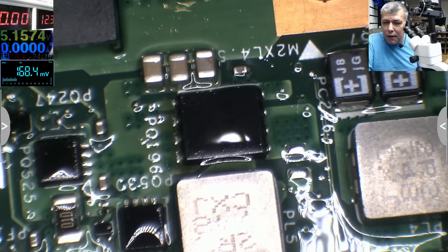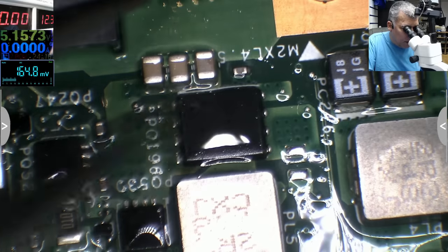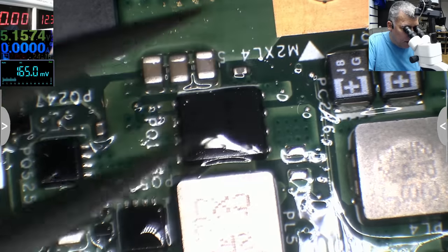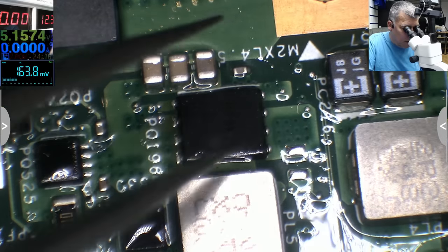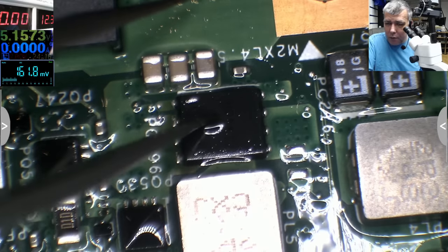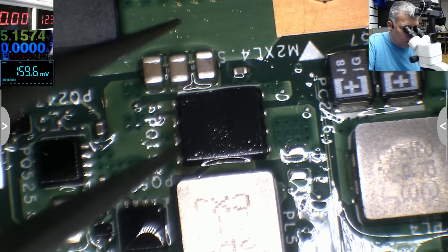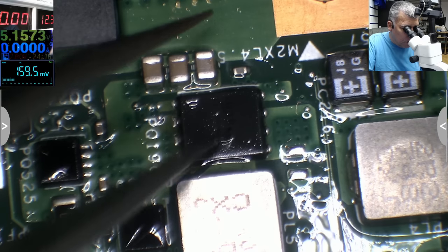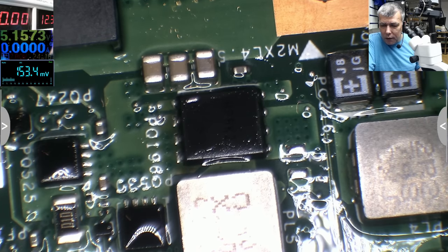You can recognize dual MOSFETs easily because they have two gates. One gate, two gate. Okay. You have three pins here, three here, and under. You see this track is coming from under the MOSFET. You have three to plus, three to minus, and in the middle of the MOSFETs, as in a power supply, you have this track with a coil. So let me understand. The MOSFET somehow is shorted, but we still have 1.2 on the output. Give me 1 second.